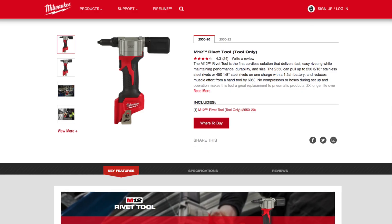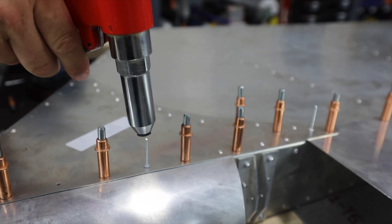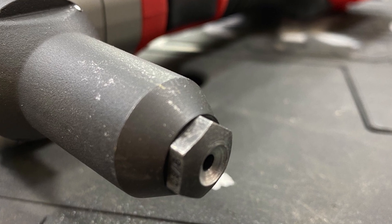I had a question about the Milwaukee rivet gun. We're not sponsored by Milwaukee, but when I was looking into purchasing rivet guns I bought the factory air-recommended one, and I set up two different guns — one for the A4 rivets and one for the A5 rivets so I don't have to switch out the head. One thing you'll find with the Zenair rivets is they actually have a machined head on them. Instead of just being a flat pop rivet head like you'd find at the hardware store, Zenith has machined those out so when you squeeze the rivet it rounds it and makes a nice tight fit, and gives it an aerodynamic look on the outside of the aircraft which will improve speed overall.